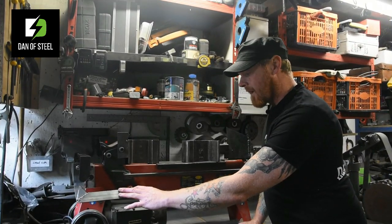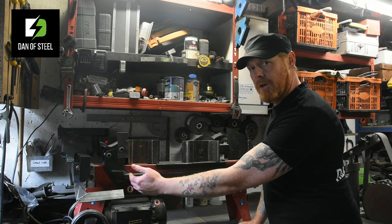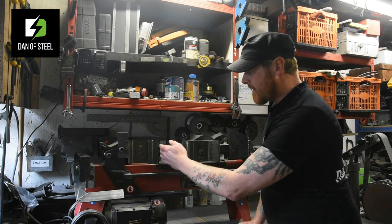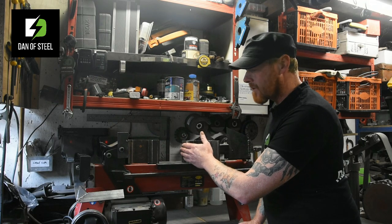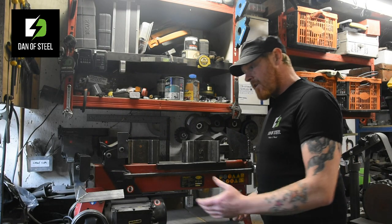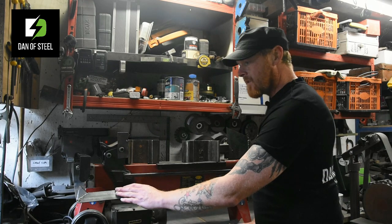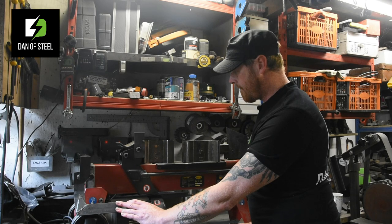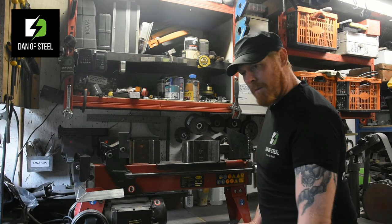Well, we've got the handle covered there. But what I'm showing you now is a standard default. So this is the piston in its fully retracted position. If I'm going to be working a lot of steel in a day, obviously I don't want to make up that ridiculous amount of distance every single time I try and do a squish, because I'm losing the heat in the material and it's causing me to lose efficiency. So what we've done up this end, again, I'll do a little zoom in for you, is I'm going to depress, squish. And when I release, it goes all the way back there.